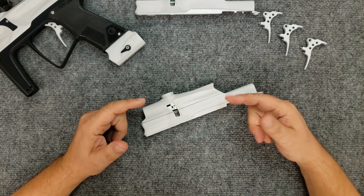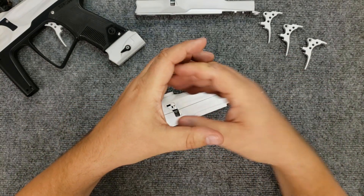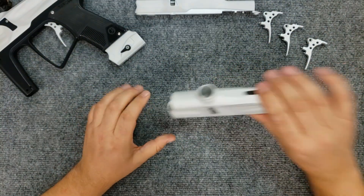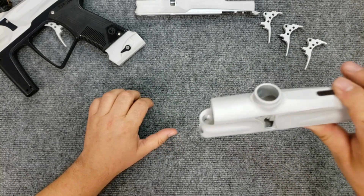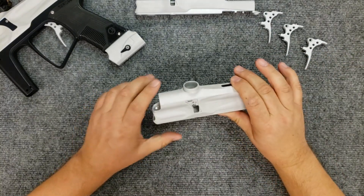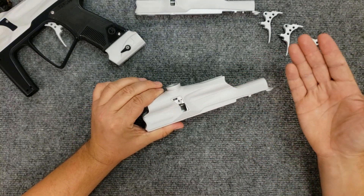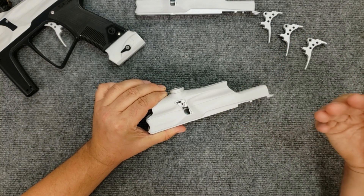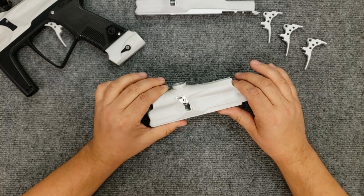The nice part is because it creates these pockets, you can put dye in there. So you can come up with all the colors — that's basically what they do. They anodize the gun, dip it in a dye, and some people are really good at that. You end up with something that's both beautiful, colored, and functionally very strong as a surface coating.